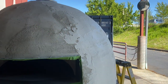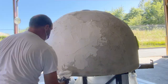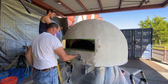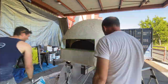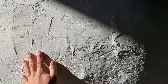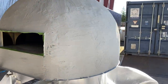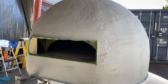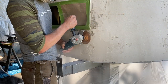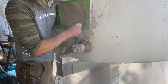The mortar is more of a structural base, while the thinset is more of a cosmetic base. As you can see, that side is very smooth compared to the other side. The only tool used for this entire surface is a six-inch knife — worked out perfectly and you're able to encapsulate the whole oven very easily with just that. The next day, it is rock hard and solid as can be. If you do have some high spots, I take my grinder with a diamond blade to remove any excess mortar that was a little too thick.